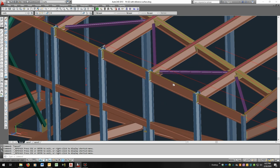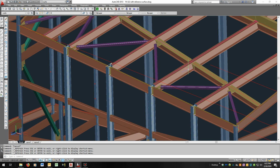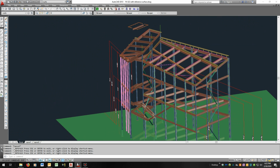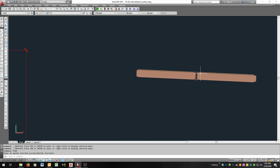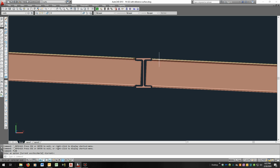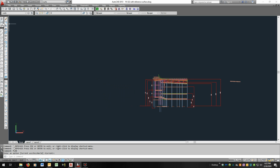When I get to the slope, these 1, 2, 3, 4, 5 I-beams were supposed to be rotated perpendicular to the slope of glass. They're in web vertical. And if I go over here, hang on a minute. I've copied a little bit out, and you can see the purlins have the angle that they should, and these are web vertical. So this beam needs to be rotated so the top is in plane with the purlins. That's going to make a big difference to the skylight.